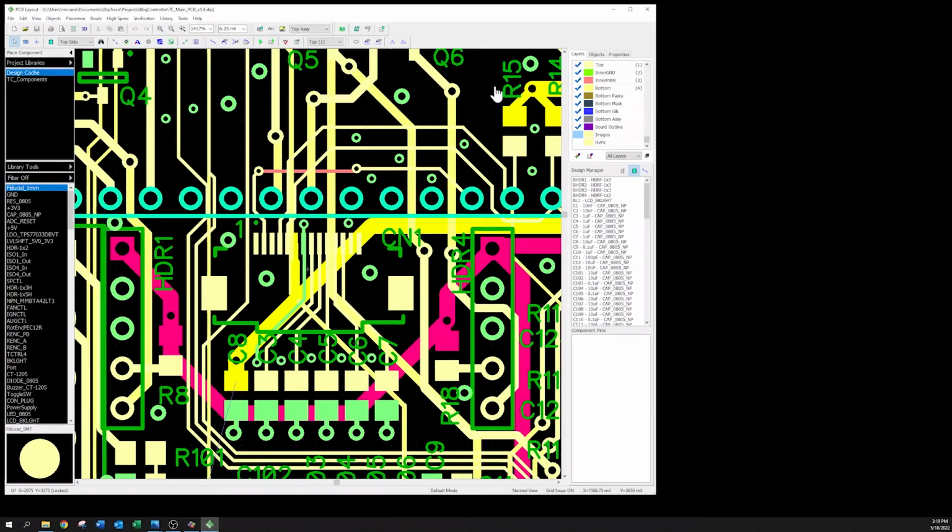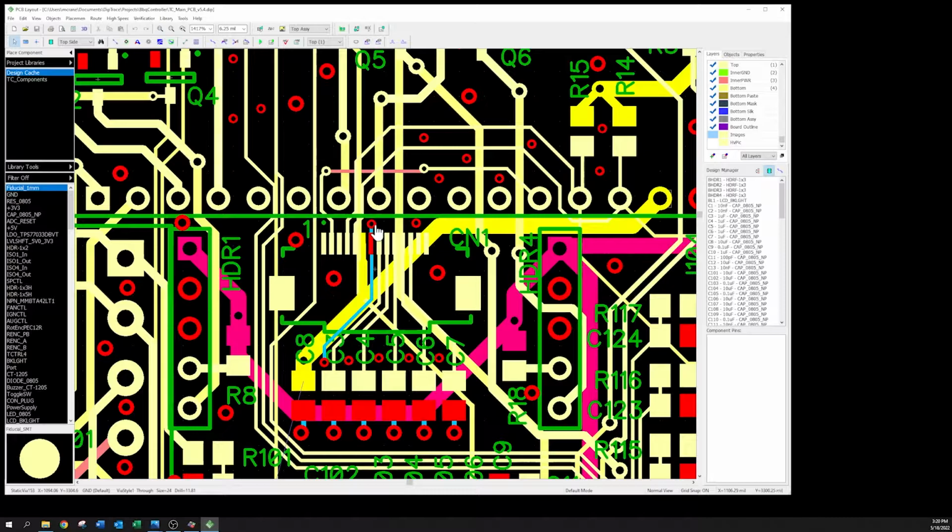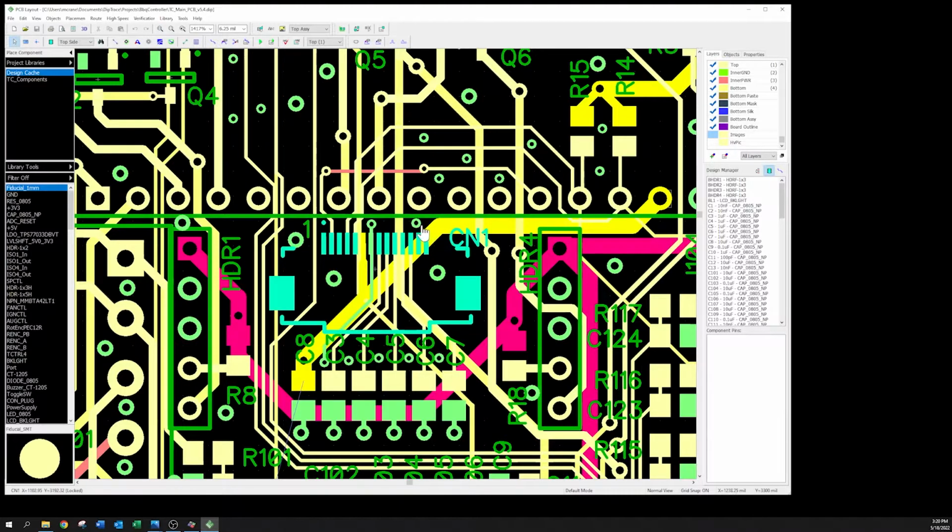And these are the two pull-up resistors, R14 and R15 over here. These guys right here are the pull-up resistors, right? And here's the pins going into the ESP32. And so I'd originally ran the SCL and SDA lines this way and right up here. And you can tell it's very tight right in here, right? And I had to move these grounds around, and I actually think I deleted that ground. I just moved this one out of the way.